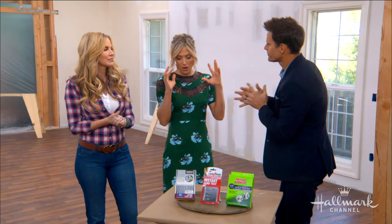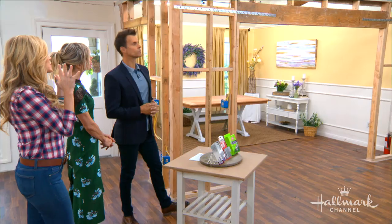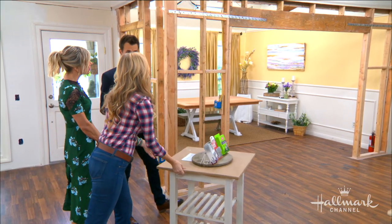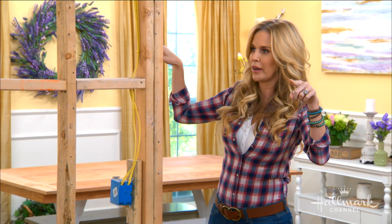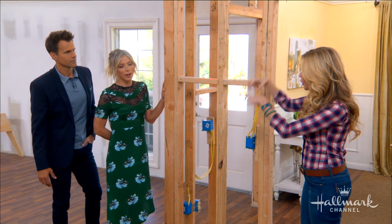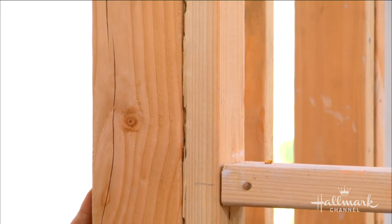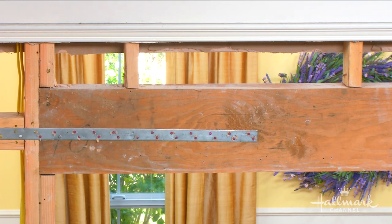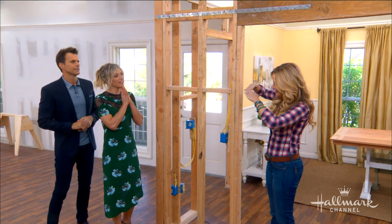Once we've taken everything down, how do we know if it's structurally sound? I would say call a professional, but there are some markers you can check. One is this four-by-four right here — a four-by-four indicates a load-bearing wall. Two-by-fours probably means it's not load-bearing. All exterior walls are load-bearing; it's what holds the house up. Some interior walls are also load-bearing. You also want to look for headers — we've got one there and one above here. That means this is structural and load-bearing, so if we knocked it out, we'd have a little house implosion.